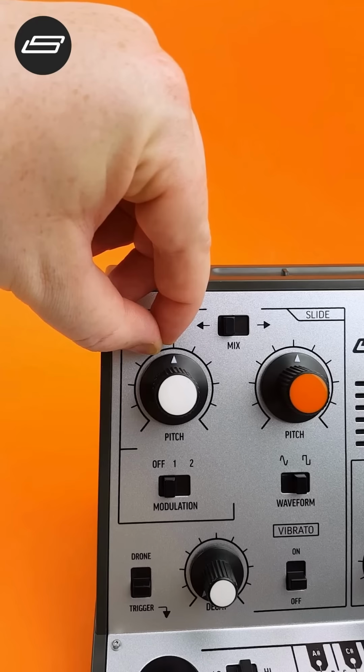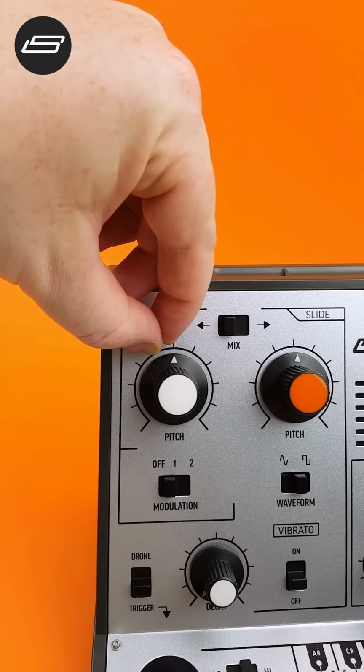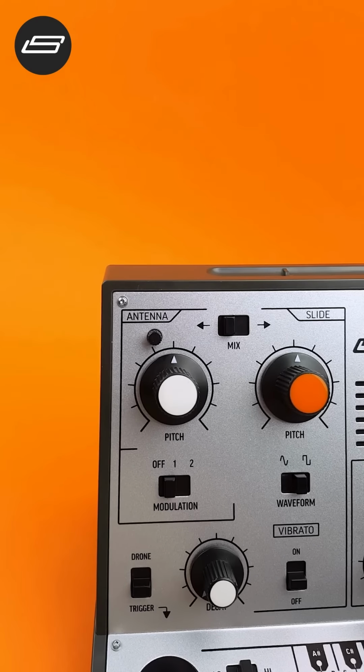If the tone starts to increase in pitch, then you've gone past the null point. Don't worry though. Turn the small dial back to the left and start again. When you remove your hand from the dial, it should be silent, but may make a high-pitched sound. Don't worry though, move to the final tuning stage, which is next.